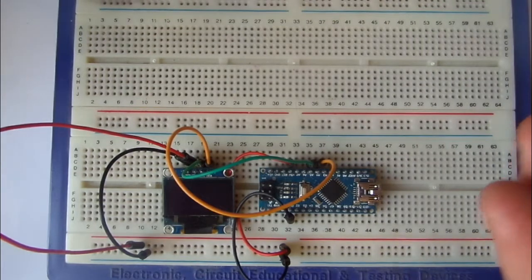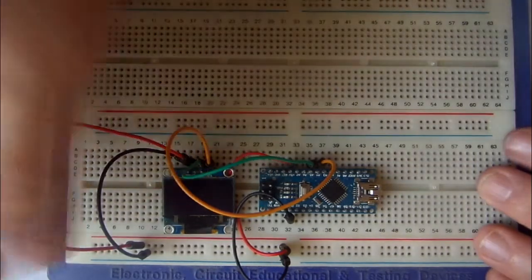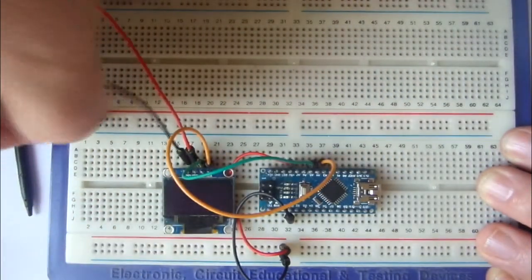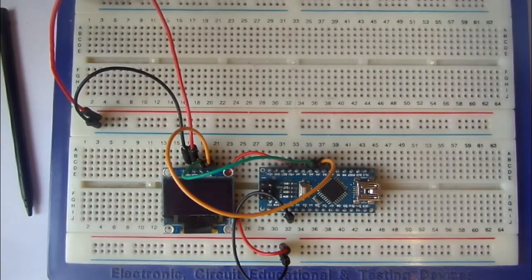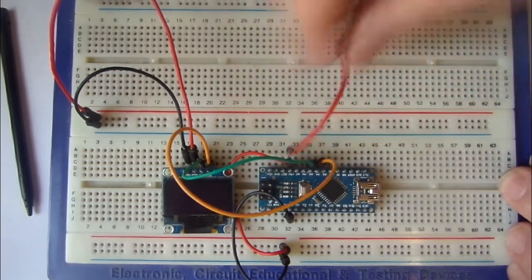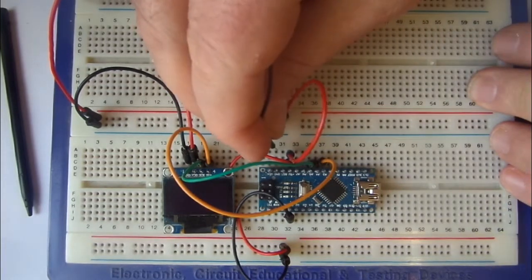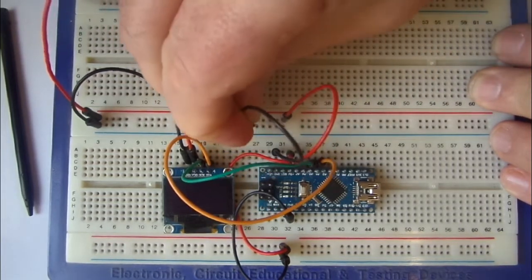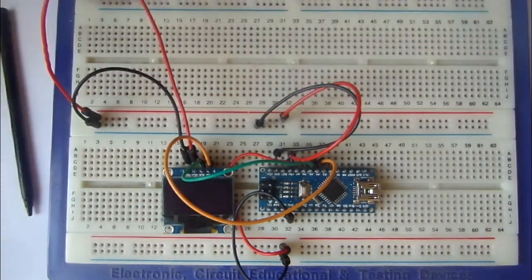So we are going to put these onto the board over in this position here, and we just need to tidy up the board a little bit first. We'll move the power supply for the OLED over here. We haven't got any power rails on here yet so we need to sort that out. We'll quickly connect up the Arduino - 5V out there, 0V out there - to ground there. There we go. So we have got power back to there and we have cleared up this area for the push buttons.